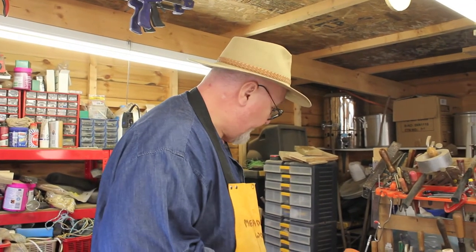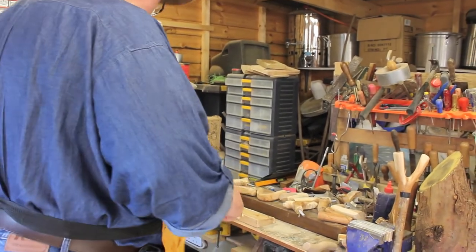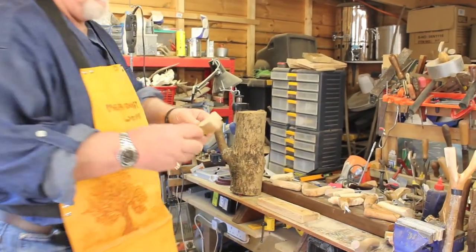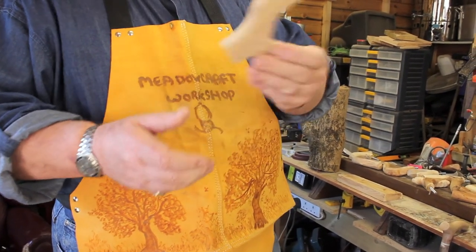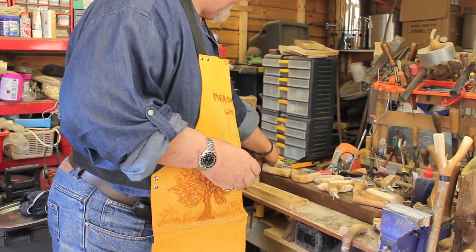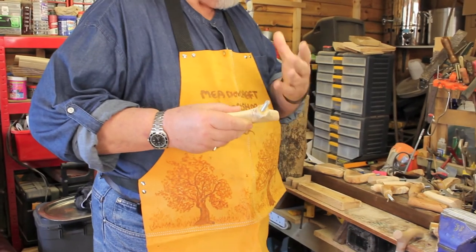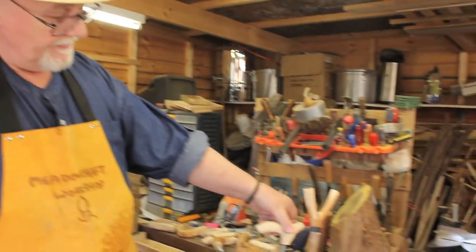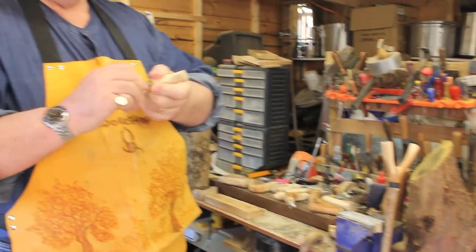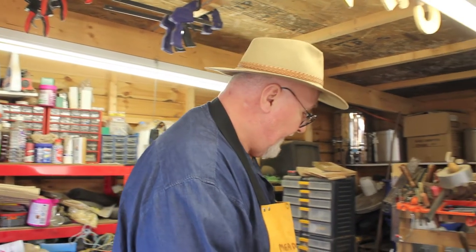Once I've got a blank sorted and marked out, the next step is to cut it out. Here's one that's already been just roughed out with a hand saw - you shape it around and get the approximate shape, then you start with rough sanding using heavy files and rasps to make a shape. Once I've got the shape formulated I put a shaft in it, because that makes it much easier to work in your vices, but it also provides tremendous strength - it's embedded in there about the same depth. That's why I describe my sticks as working sticks - I know these are going to stand up to good use.